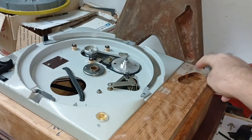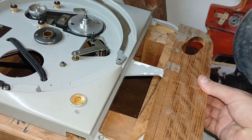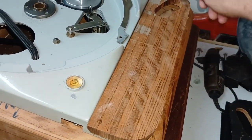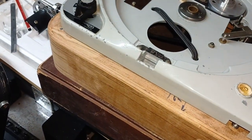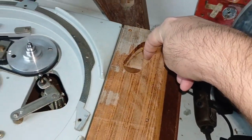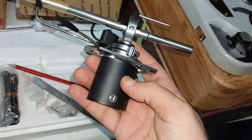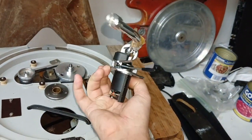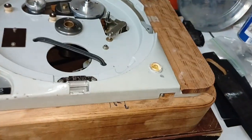Okay, so having ignored the cutaway in this top right corner earlier, let's focus on it now, right? So we have to remove a certain distance down in the area below this arm board, right? This section here, right? So looking at it closely, we need to drill down here. But how much are we going to drill down? We need to drill down a certain depth to accommodate this black section, right? And some RCA jacks sticking out to the left side of it, right? So we have two thicknesses to take into consideration.